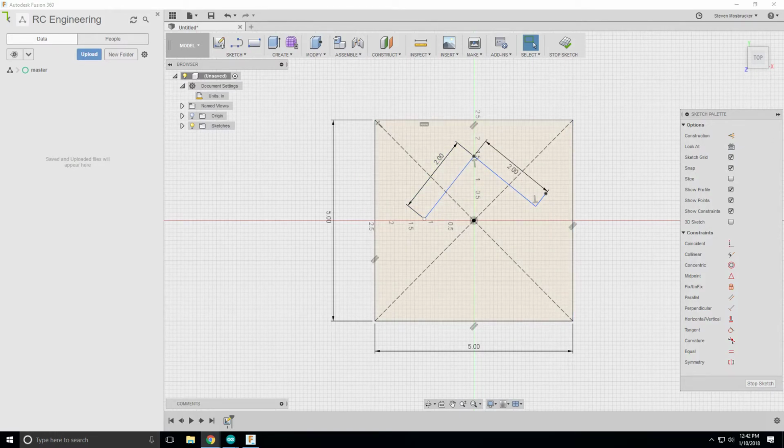And then also this is going to be very small, so we need millimeters to inches. The biggest motors usually for brushed, if they're not geared, is maybe 66 millimeters, which is almost 2.6 inches. But I have some geared large canned motors that turn 6-inch blades, so that will probably have to have a different setup. But we want to keep this one compact for right now. If I want to have a different one, I'll change the model, so I don't have to store that big old one all the time.